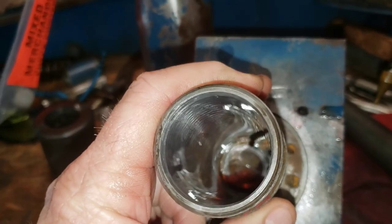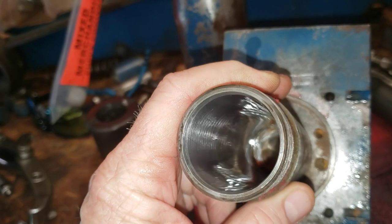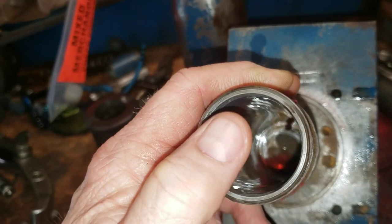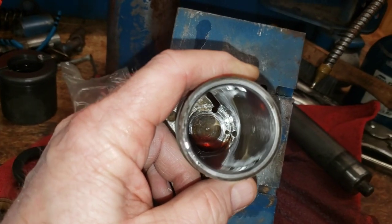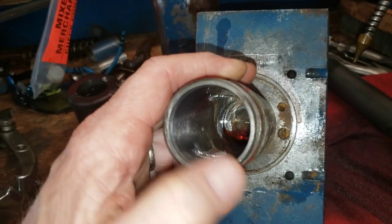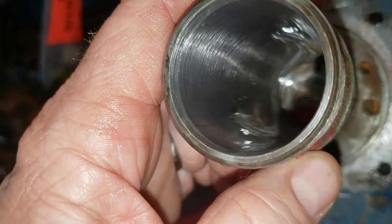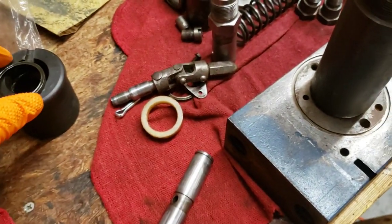After a little further inspection I put some mystery oil down in the bore to keep it from rusting any further. I'm going to get in here with some emery cloth — I was reading the instructions on the parts website and you can get emery cloth on a long rod, put it on a drill, and hone this surface a lot finer. It looks really good now because it's got oil all over it but I'd like to get it a lot smoother.